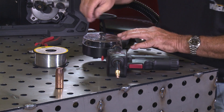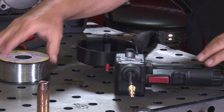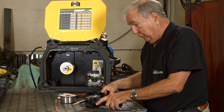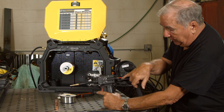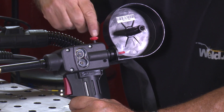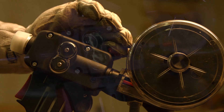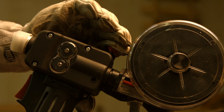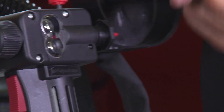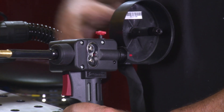To mount the roll of aluminum, we unscrew this plastic cap and drop it on. Very similar to what I did earlier when I straightened a little bit of wire to shove it through the drive roll system, I'm going to do the same thing here. You can see there's a piece of Teflon sticking out — that's going to be our ingoing guide tube. This red button on top, if you watch the drive rolls, one is the drive roll and the other they call an idle roll. If you push down on it, you'll see it spreads. That allows the wire to get past the drive roll, so just straighten out a section of wire, stick it in there, hold that down, get it past there, let go, and that'll clamp down on the wire and hold it in place while we finish mounting the rest of the wire.